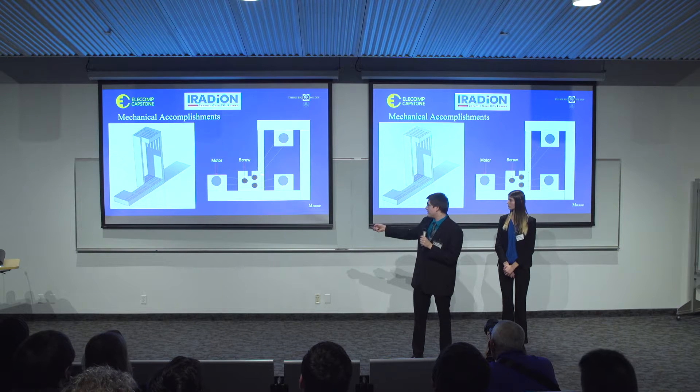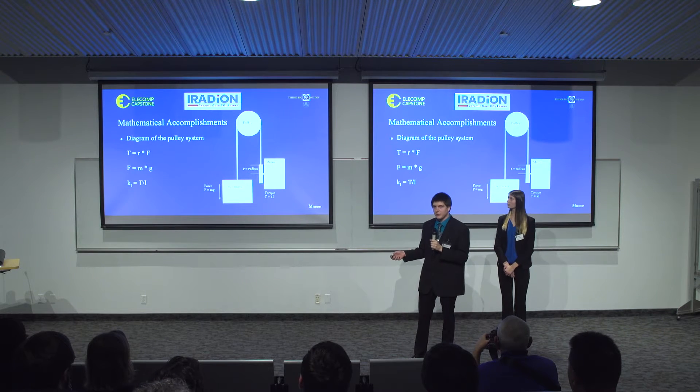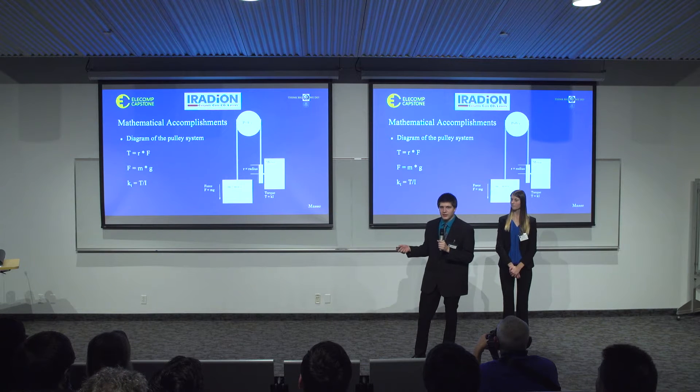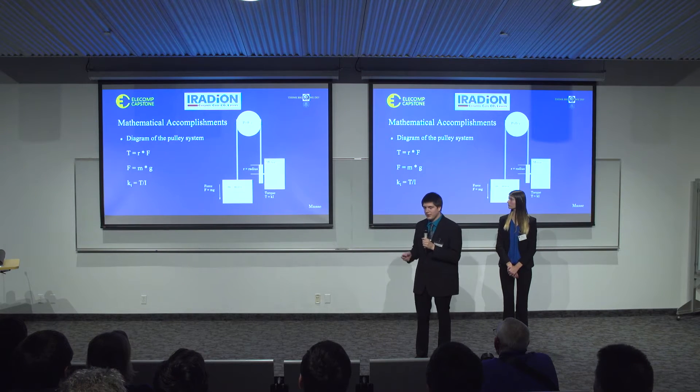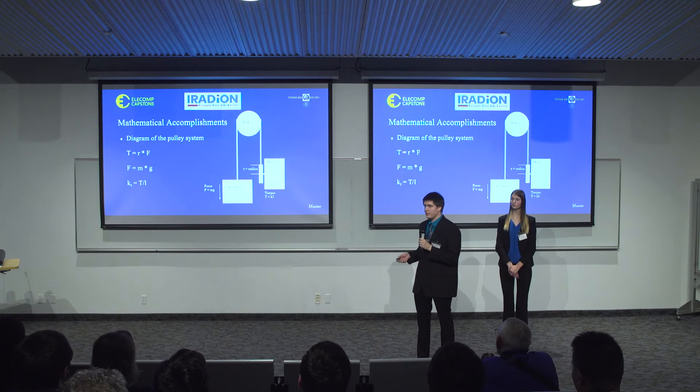During phase 2 of the project, there will be an active laser going through here, so the space will have to stay clear. The important part of the project is constantly knowing the torque on each of the screws. So we use a servo motor to design a system to calculate the torque output. The basic idea was to create a relationship between the changing current with respect to torque. A servo motor is controlled using pulses, which allows us to have a current variable. Using that variable in physics equations, we conducted an experiment where we increased the weight and read out the change in current output of the motor. This allowed us to calculate the torque constant. While a motor is turning a screw, we can know the exact torque on that screw based on the torque constant and the current output.